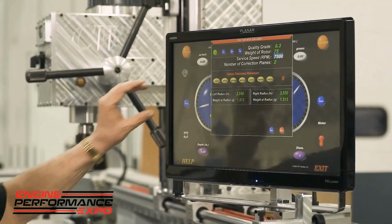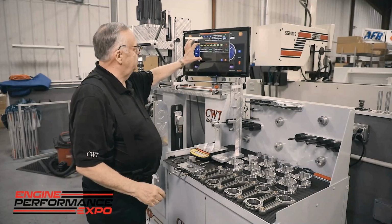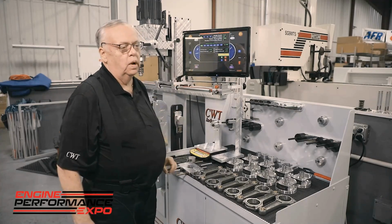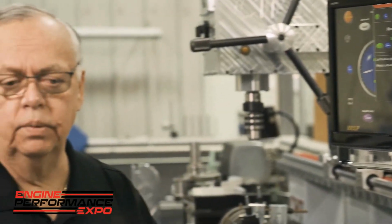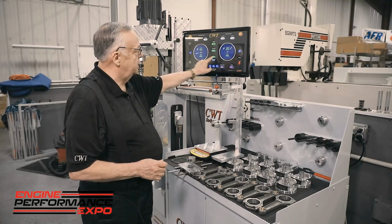Now, from there, it's also going to ask the tolerance reference. And again, being a global machine, most of the stuff that we do here in the U.S. is ounce-inch. So it immediately calculates out, and it tells us that our tolerance is going to be 0.189 ounce-inch. Now, you got to appreciate, if you go back a decade, racing engines were 0.2, right? Well, this is what the OEM is doing now. You have to hit these tolerances. So what I'm going to do here now, I'm going to just say yes, and it embeds that tolerance into